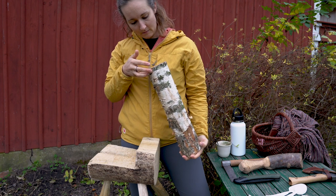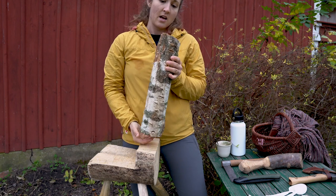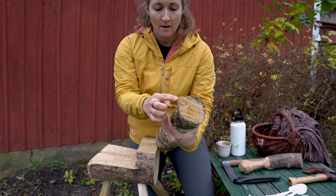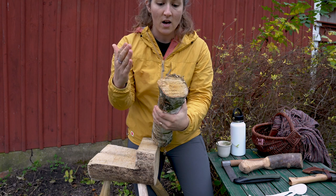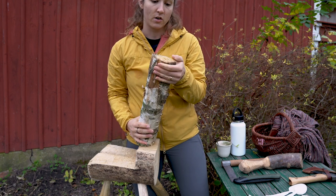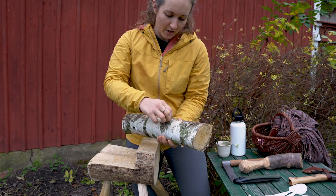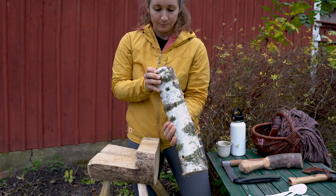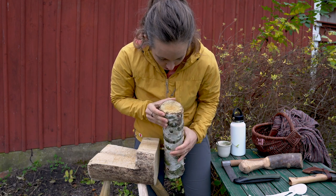So I'm going to look at the wood for a few different things. First, I'm going to look for things like branches. So here there is a branch and it's coming down the side, and that will make the grain move around. It'll be harder to carve, it'll be harder to follow the grain. And so I'm going to look for those. I'm going to try to avoid those. These may be issues, but I think they're old enough that they just might be on the surface, so I'm not so worried. I'm also going to look for any existing cracks, which I don't see any.